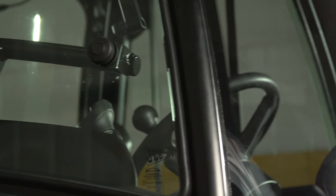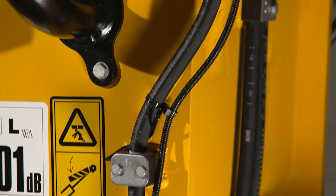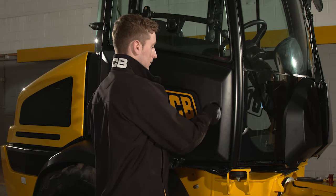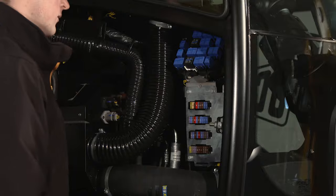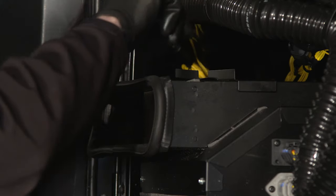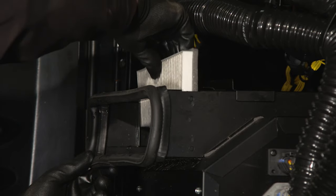Continuing the inspection, check the cab glass and mirrors for cracks, reporting and replacing items if damaged. Check all the lamp lenses. Visually inspect the hydraulic hoses and fittings for damage or kinks. To access the fuses and relays, open the side panel and remove the cover. If a fuse blows, find out why and correct the fault before installing a new one. You will also find the cab air filter here — shake out loose dust if required, and replace if severely blocked or damaged.